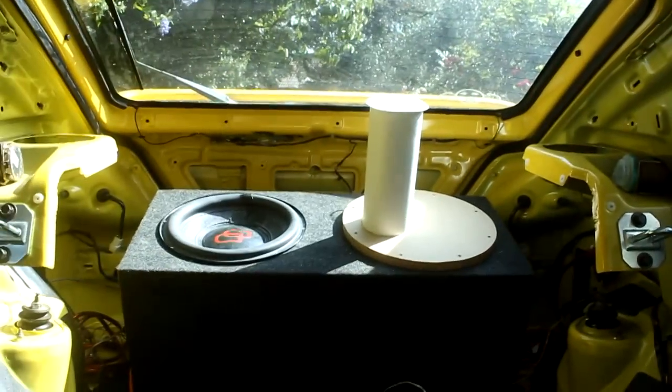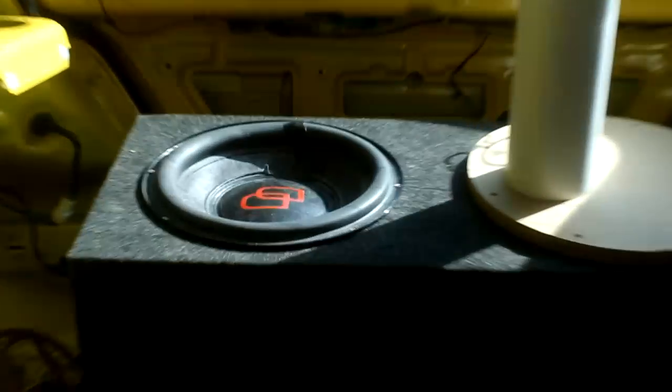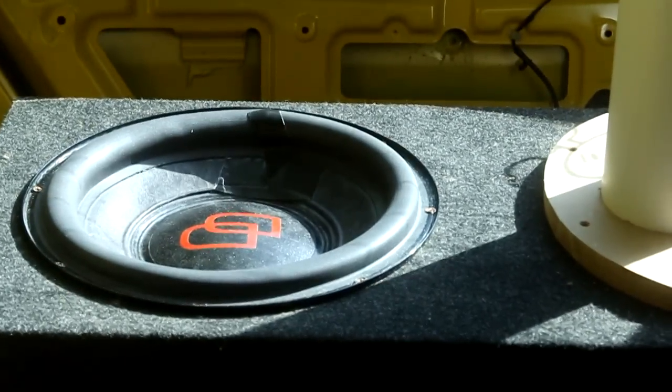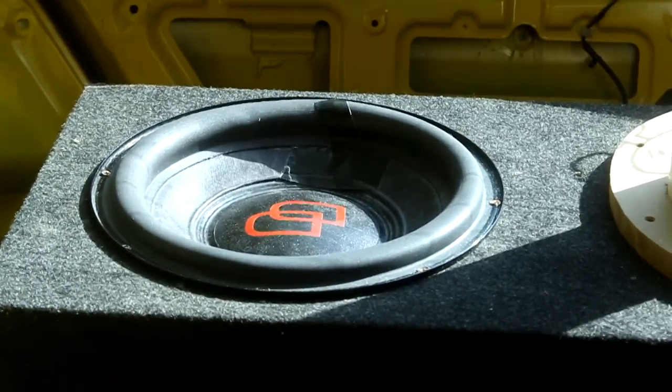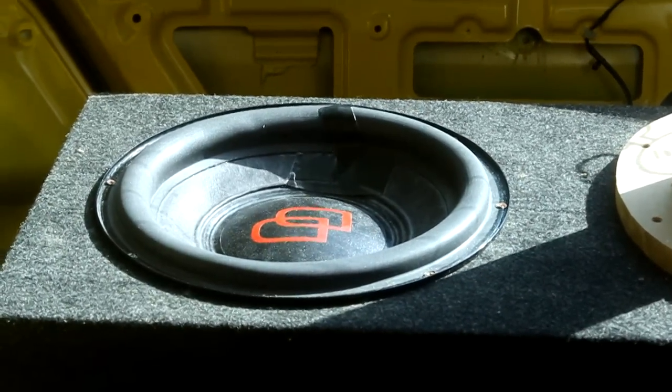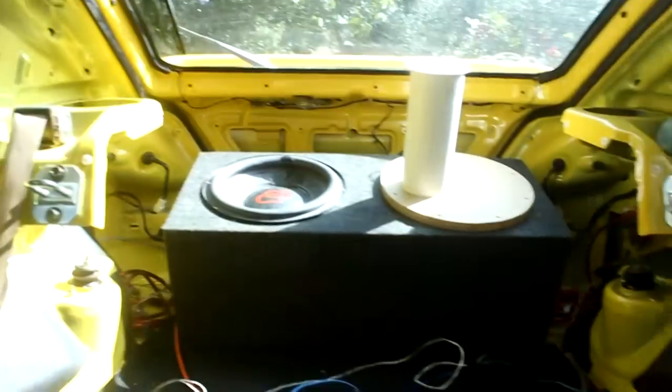Okay, cool. So 30 hertz, maybe a little low for it. What I've got a problem is on the sub there, the tape and everything on there is a tiny little air leak, and also where the cone has been deformed already, it's kind of like flexing and shaking about, so I'm losing a lot of pressure through the cone just being warped. So let's try a little bit higher frequency. Let's go for 35, go on up in here on my little phone app.